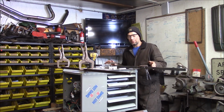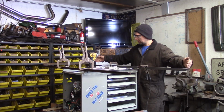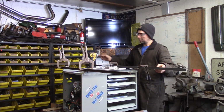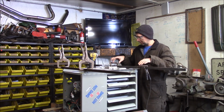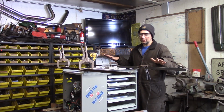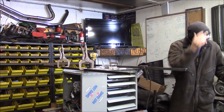Okay, what I'm doing now is I'm building a bracket to hang on the ceiling. I got this 1x1 angle iron that's going to span three of the trusses and bolt to the back wall, which should be more than plenty to hang this unit. So I got it clamped on here. A couple of bolts started where it's going to hang. I'm going to tack everything together, then take it off the unit, check it to the ceiling, and then fully weld it. So let's make some sparks.